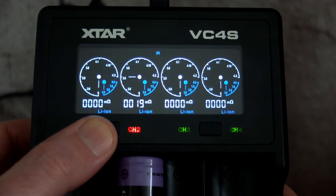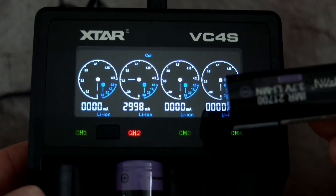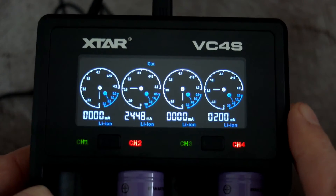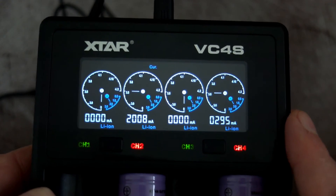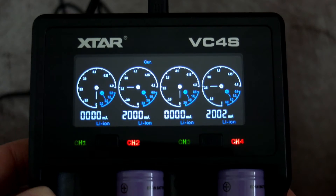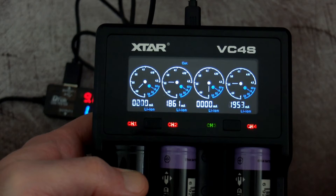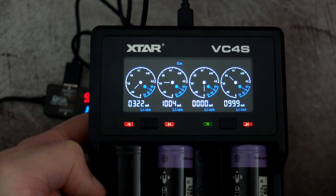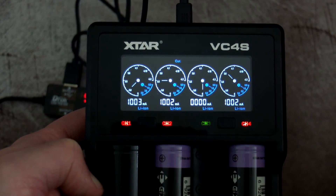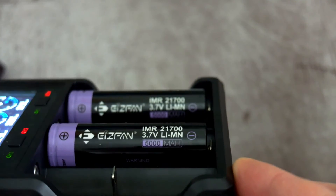For charging speed — I have a fairly new 21700 cell. Hitting the left button shows a very low internal resistance, and it starts charging at quite a high rate: 3 amps. This cell will take a 3-amp charge, but I have no way to manually adjust this other than dropping from 9 to 5 volts by using a normal USB port. Adding a second battery, there's a brief slower charge period of about 30 seconds before it increases to full speed — in this case two cells at 2 amps, which is acceptable. But a single cell at 3 amps is a little high for me.